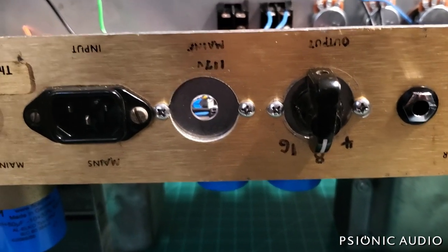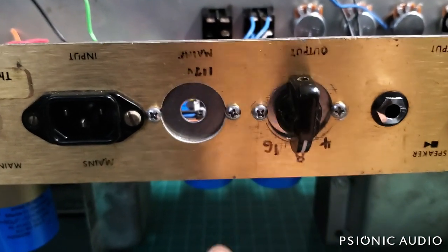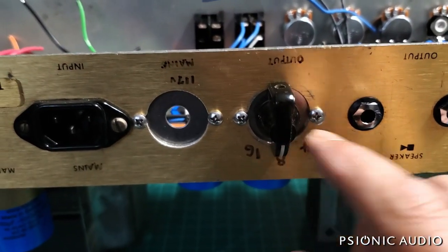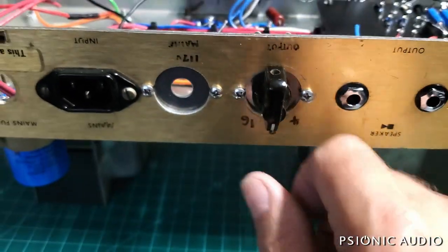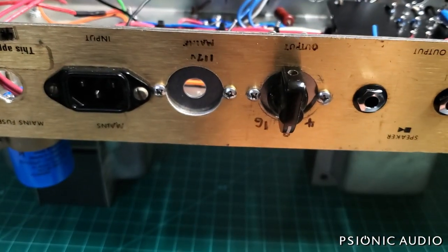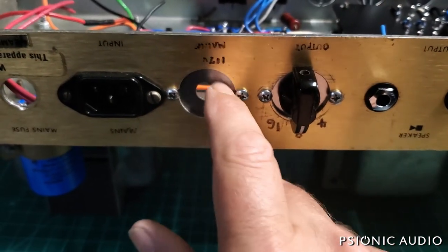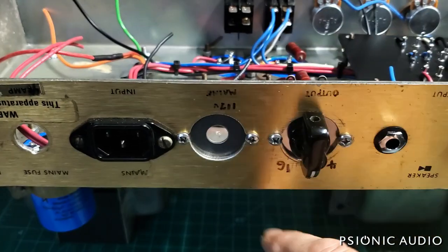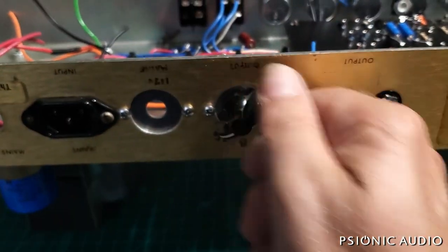All right, I'm really pleased with that. If you get the measurements right — and I'll give those to you in a minute so you can do it yourself — it's pretty much self-centering. So here I've got an impedance selector switch mounted, much better than the crappy one that came in. And I could do the same switch and wire it as a voltage selector, but this amp has been hardwired at 117. So I'm actually going to do a post-phase inverter master volume, which fits the same hole, and it's right between the four output tubes, so it's great for the grids.